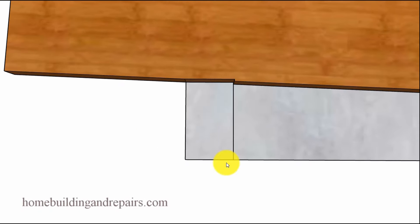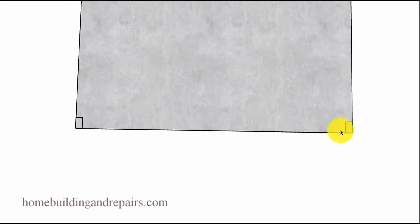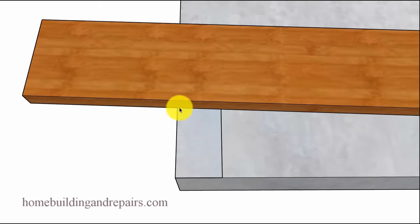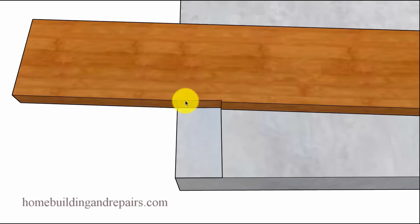Let's get started with our first method. We are going to lay out the six inch marks on the building foundation on one side and the other. Then we are going to position the roof rafter material — which does not have any seat cuts yet — in the proper position. In this example, I'm going to line up the top edge of the roof rafter with the correct point, not the outer edge. Otherwise, we won't be cutting a proper notch for our roof rafter.